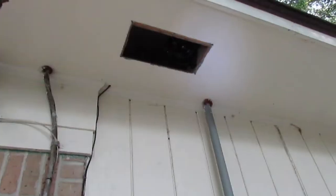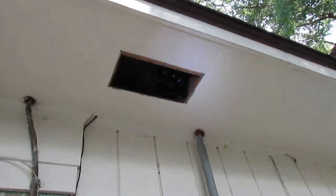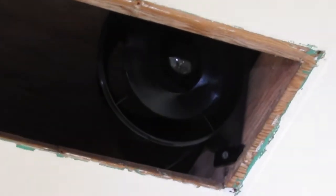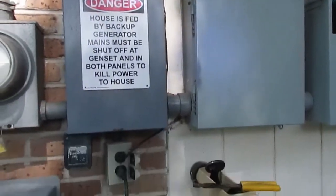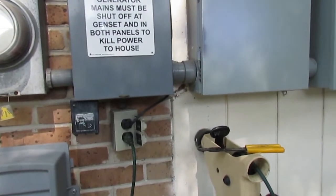So keep watching guys. All right guys, this thing is up and running now, you can zoom into it so you can see it. This went really easy — I just simply screwed it to the rafter tail right there and cut the cord, drilled a quarter inch hole for the cord to come out. Ran it all the way down, spliced it and added some more cord to it and it's now plugged in. I am going to add a timer on that so it'll run, say, 11 to 7.